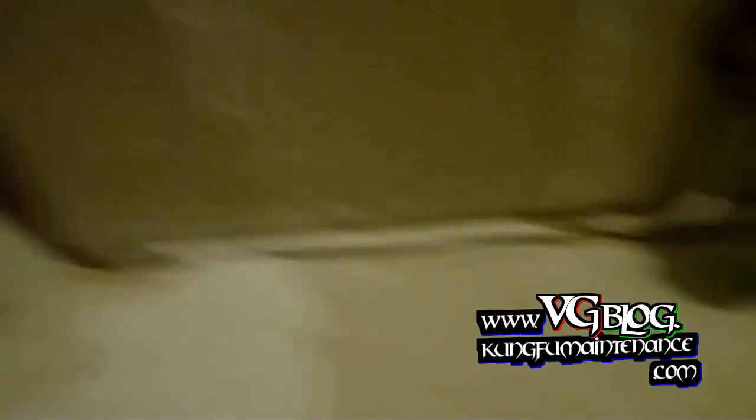So let's open this up and take a look. And where the leak is at, we'll have different options. Just kind of wanted to go through a bunch of different stuff today on condensation leaks. So let me open the service panel door here. It's got this little keyed latch that we need in order to open the service panel. I usually just use my screwdriver to turn it.